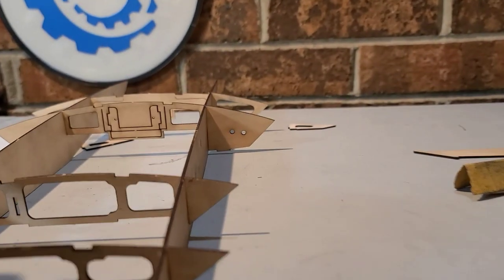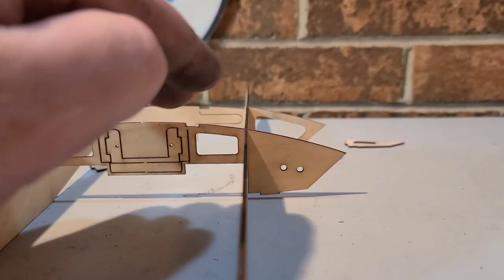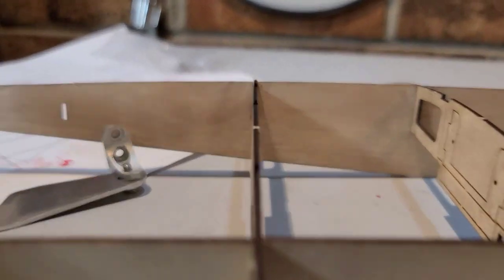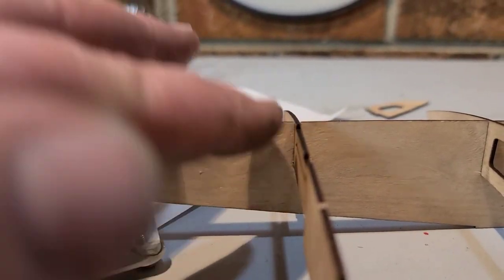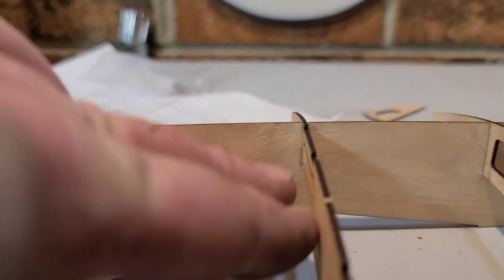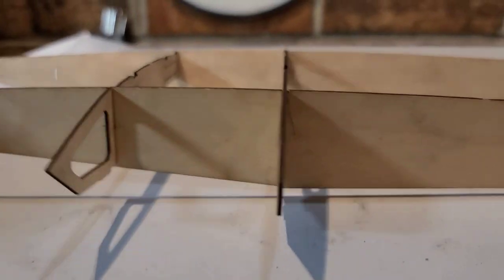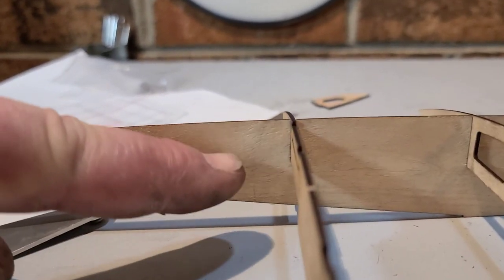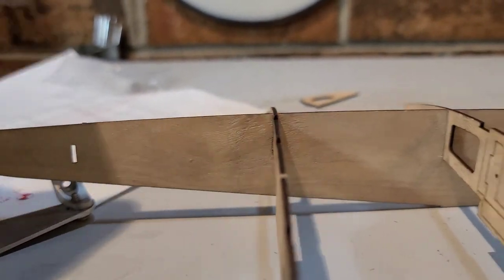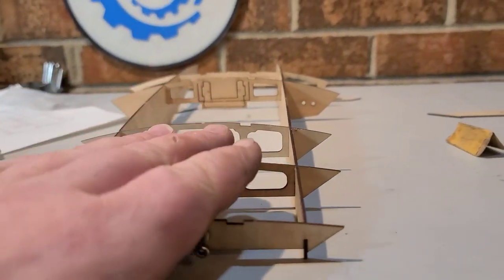All right, so I actually took a little bit of water. This board, the stringer's crooked. It was wanting to curve in, had a crook in it, and it's from the inside of a knot. It looks like a knot in the wood right here, where the grain's kind of going one way and then it's wanting to curve the other way. See how the grain in this one's like perfect, you see that? And the grain right here, it's wanting to swirl a little bit, okay? So I actually put a little bit of water on it and bent it the other way, and